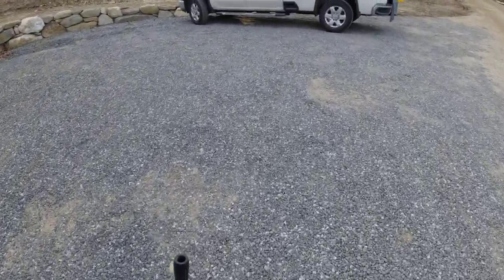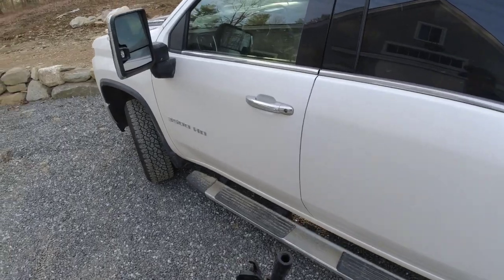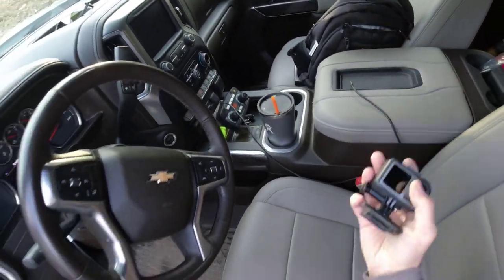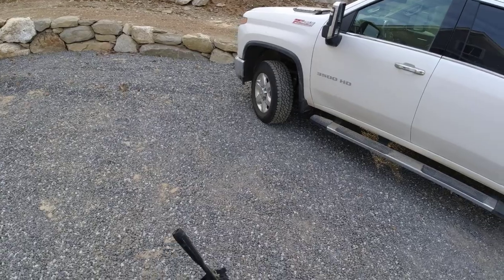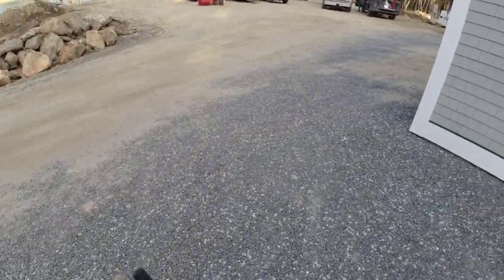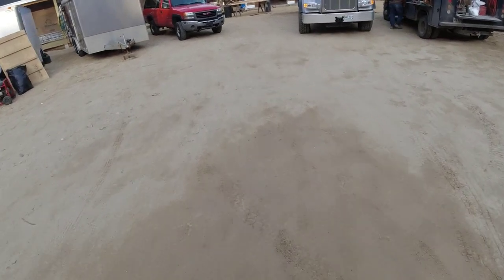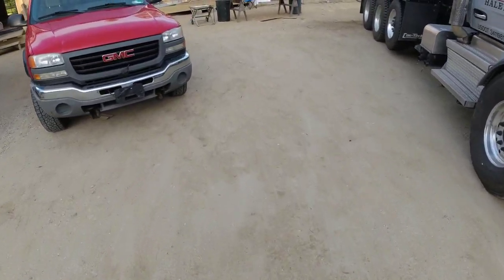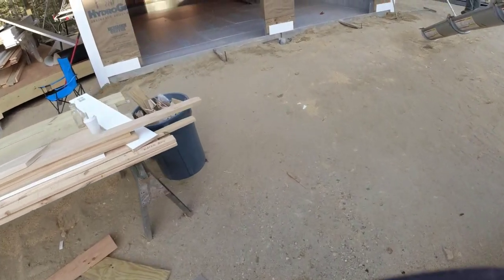I have to drive my personal truck today — gotta hustle right out of here after the pour. Luke will probably stay here and power trowel, and Darren's gotta go look at some other jobs, so we brought an extra truck. It's a year-old one-ton, got a nine-foot V plow and a sander in the back. I figured exactly what one truck could carry, so I ordered an extra yard to be safe. We're about 45 minutes from the concrete plant, so we got 11 and a half — before I figured 10 and a half. Not being able to shoot grade earlier, we just don't want to take a chance on running out.